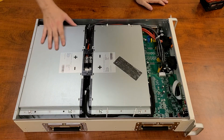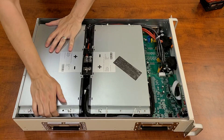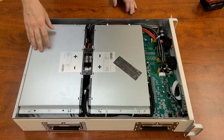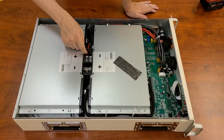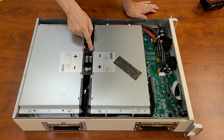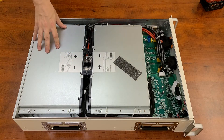So taking a look inside, the nice thing about these batteries is they've got the battery bolted right to the case. There are four bolts that run along here that attach it. I'm just going to pull these bus bars off here very carefully. The nice thing is they do have a nice plastic lining here on the way to the terminals, so you don't have to worry about your tools grounding out to the case when you're pulling this off.